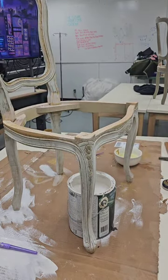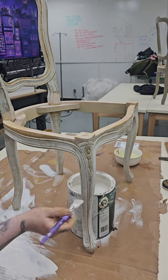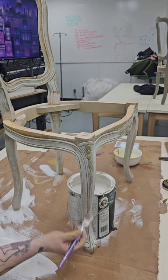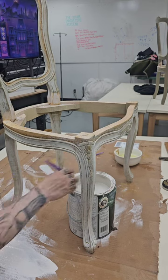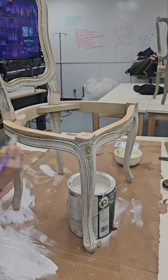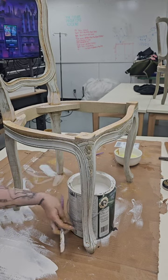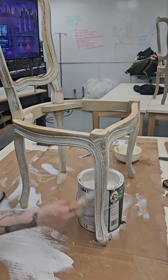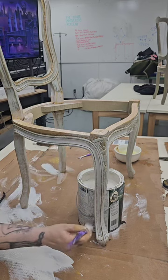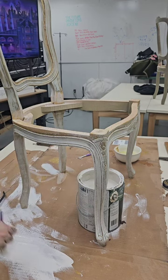Yeah, I think we're only going to need like 4 coats here. Maybe 5. This is the third. But as I told you before, once you get a couple coats laid down, this paint starts to go on smoother, because the first couple coats it's going on the sanded surface, so it's absorbing, and once it's absorbed it creates a slicker surface. Now it's flat paint, so it's absorbing the paint that goes on top of it, so you don't need to sand it as much if you're putting it on thin coats, but maybe 5 coats it's going to need. So that we have a solid buildup, which is what we need in most of the areas.